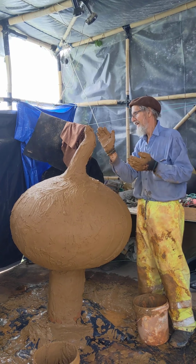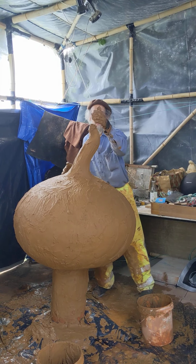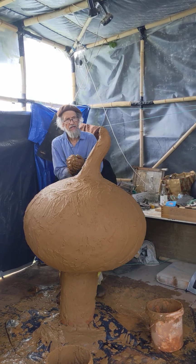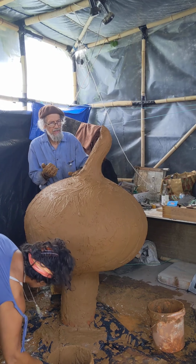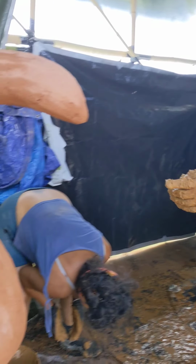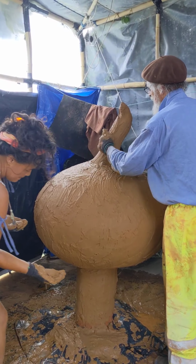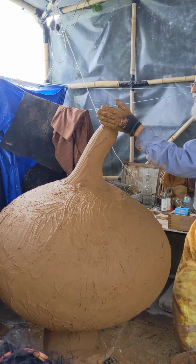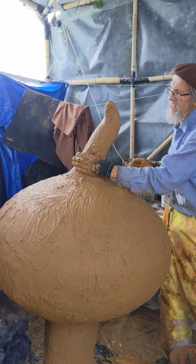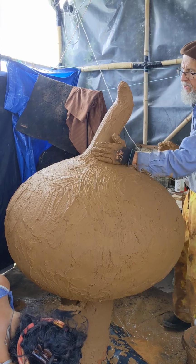So, this is Renaissance Workshops on a particularly important day when we're putting on this very smooth silica sand plaster for the final coat, and we're rubbing it in really hard, really well, so it sticks to the sanded and smoothed down second coat. So the third coat is a little lighter, and it's got silica in it, silica sand, white sand instead of just ordinary sand. So it makes a bright, hopefully a lovely bright sort of gourd colour.